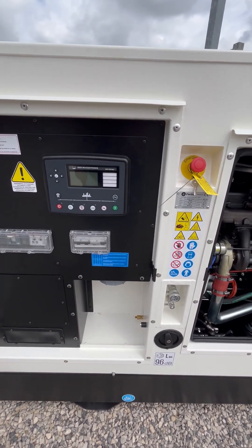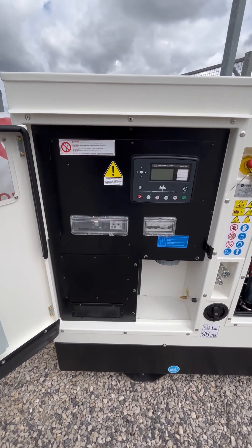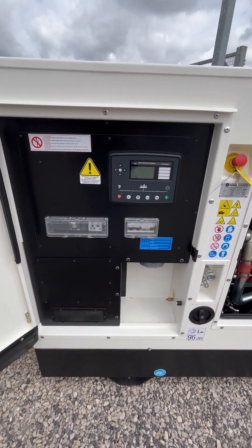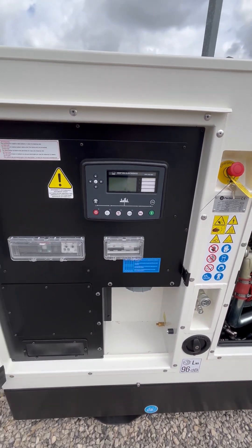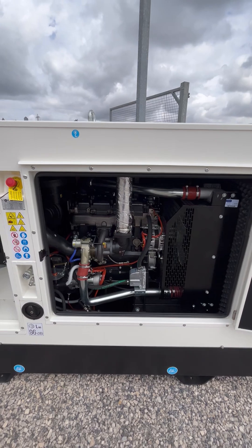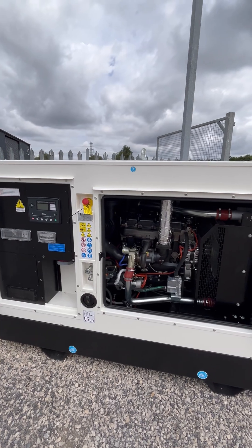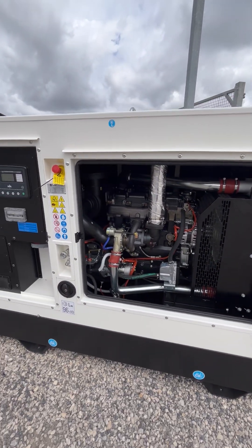You can split it into some form of distribution. All the sets now, as part of UK regulations, come with an RCD fitted as standard and ABB four-pole breakers. The socket is also protected by an MCB and RCD. We've upgraded the controller to a 7320 and a battery isolator is fitted as standard. This entry level spec comes in white, which is a nice neutral color, and you've got a central lifting hook on top, or you can lift the generator set underneath too.